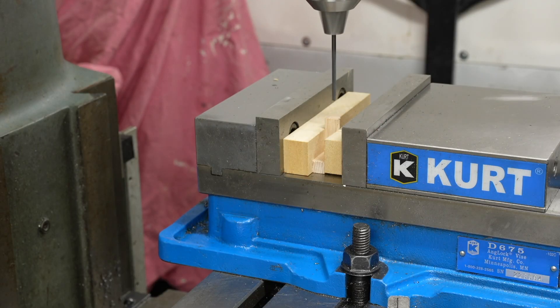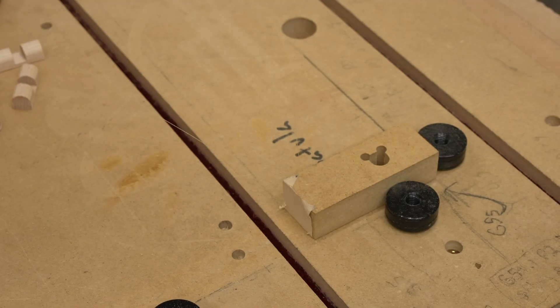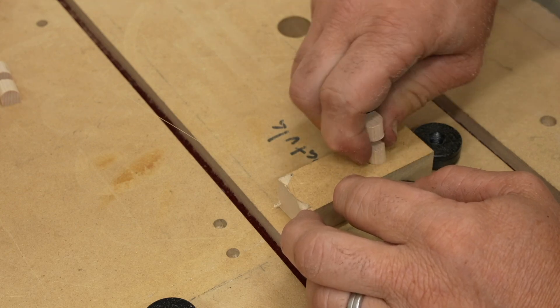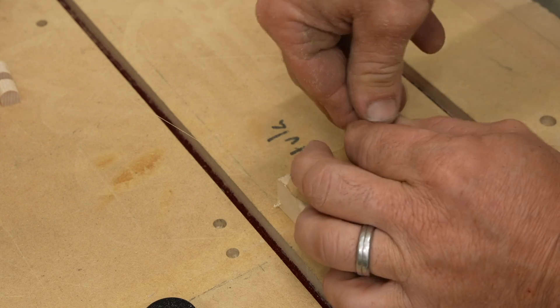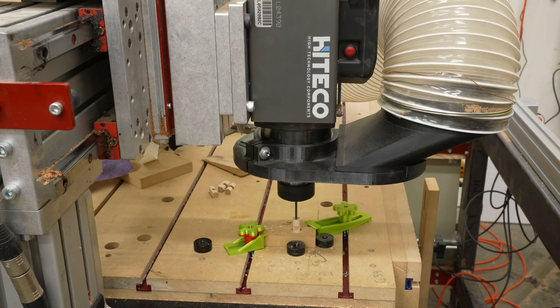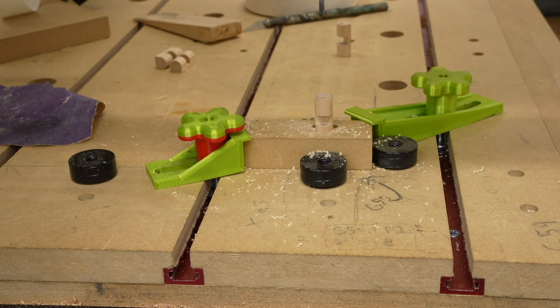I had to create a hole down the middle to slide some type of shaft, and this was a little bit tricky. At first I just tried using my mill to drill them, but they weren't aligned perfectly. So I went and machined a little Mickey Mouse shape out on my CNC machine out of a piece of MDF to hold them very precisely — I could shove these pieces down in, it had zero tolerance, and that held it down enough to run an eighth-inch bit down and out.